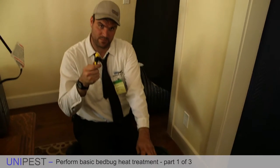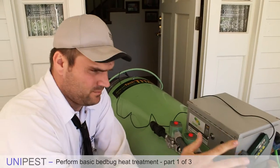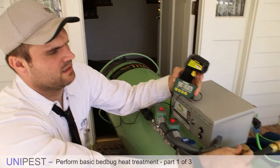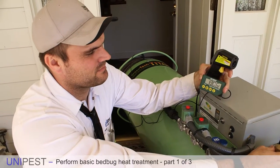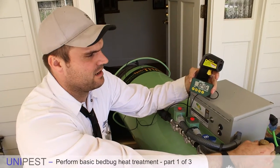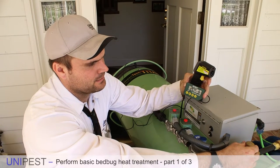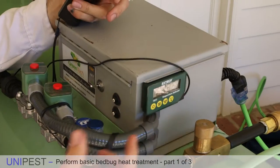Now that the room has been properly prepped and dusted, it's time to turn on the fans and actually begin our heat treatment. You're first going to turn on the propane tanks, then turn on the gas slightly, give it a little bit more gas — you hear the spark — and now the temperature is spiking so we know it's working. Before when we tested it out, we realized we had to be at a pretty high temperature because we were losing almost 40 degrees in there. So let's go back up to that 195-200 that we needed to be at. There it is — it's consistently at about 204. We're going to stick this back down and go into the room to double check.